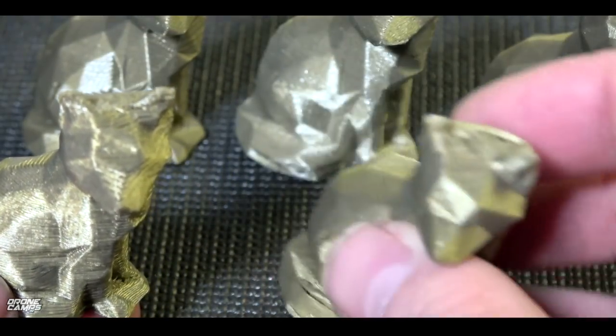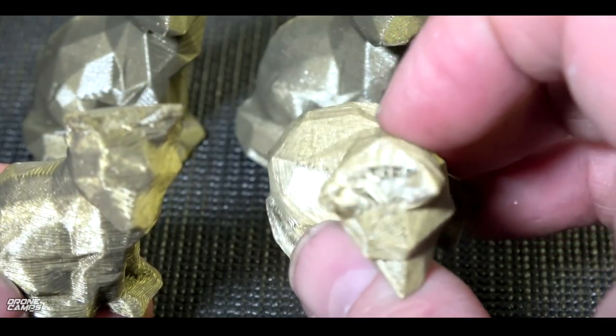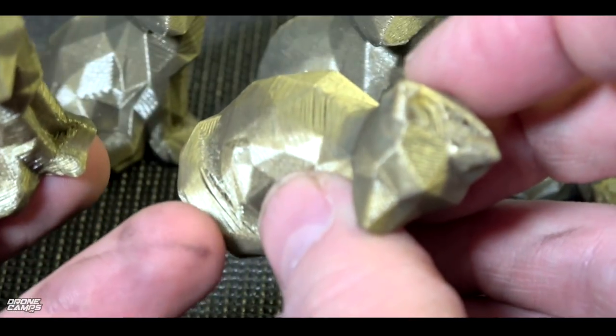And that's where some of these printers actually fail. This one's the A3S from JG Aurora, and you can almost see holes through the top of that one. So that setting took a little bit of tweaking to get right, and there's a little bit of holes down here where the tail is.